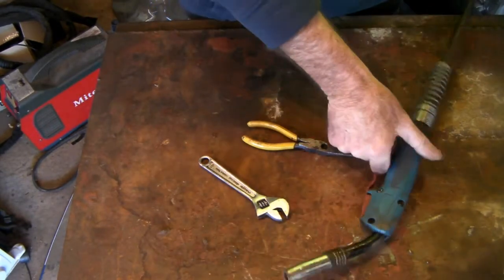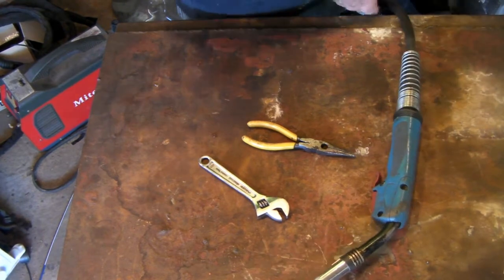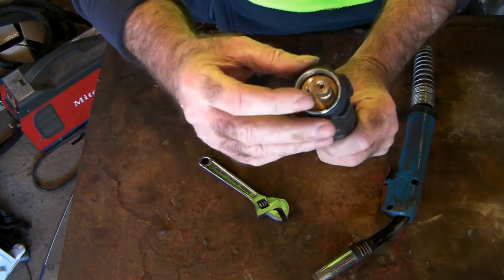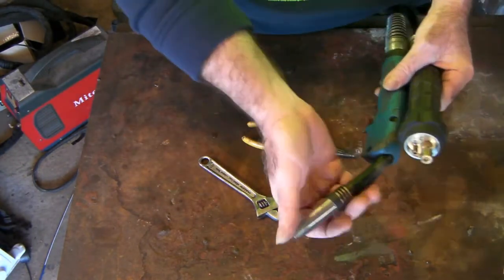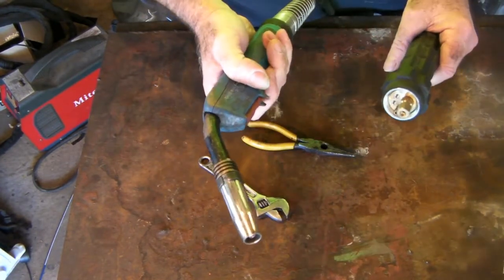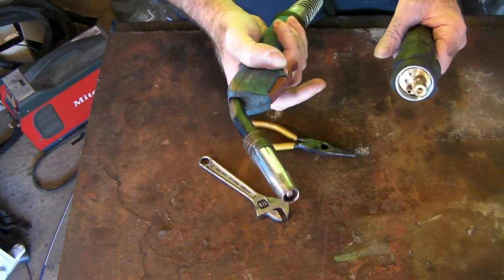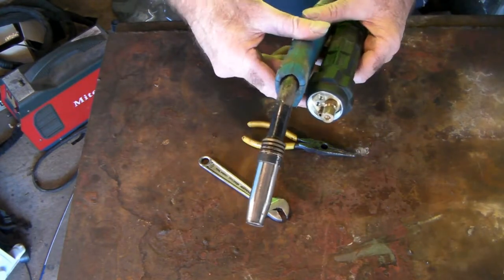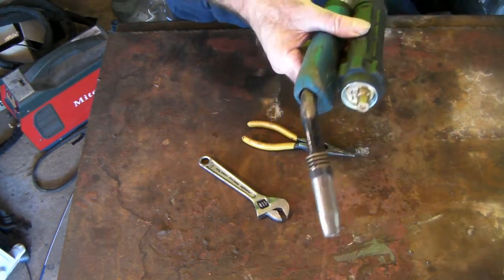And we'll go back to the other end. All looks good on this end, like so. Feed your wire through and you're ready to go. You'll find that will make a huge difference on your MIG welder. Well, I've found that anyway. It makes your machine go from an old shitty thing to running like new again. It can make all the difference for $10. So that's how easy it is, guys. It's as simple as 1, 2, 3 really to change the old MIG torch liners.